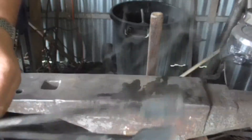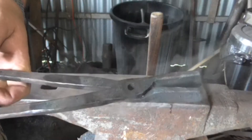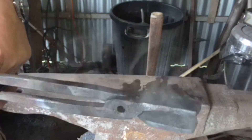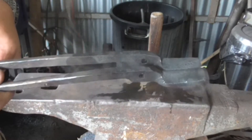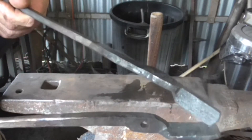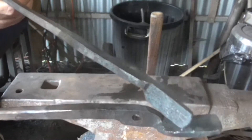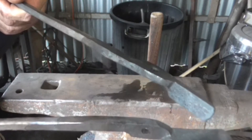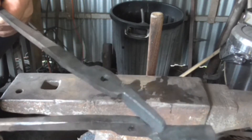I was heating that in the fire and then I realized I hadn't dealt with the shape of the tongs that I want. If I'd have riveted them I'd have been completely stuffed. I want these to hold flat stock, so the largest one — the one nearest the camera — I'm going to split that down the middle. Split that down the middle, then bend the ends over, and then when I've riveted it I'll form them into a V of the correct width. So first job: split them.